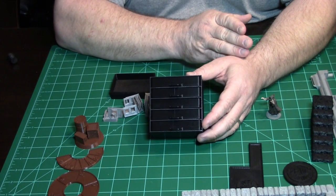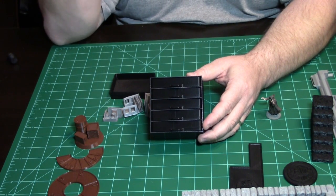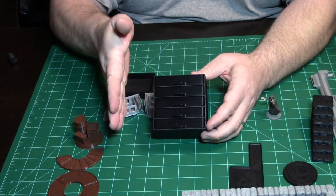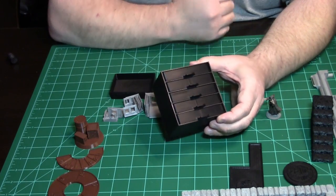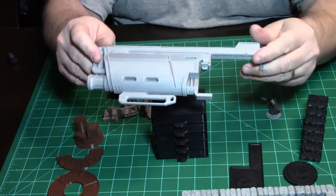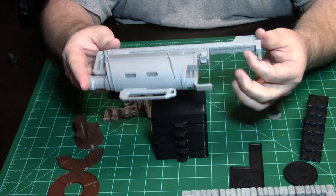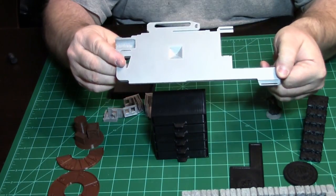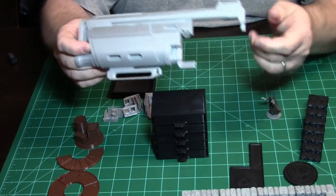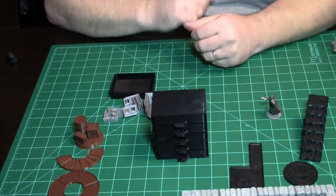If you want something a certain size and it's not that size, that's where digital calipers come in. You can measure it and scale in Simplify 3D — it has a box that locks the ratios. Scale to 125% and you get a box just a little bit bigger. You can do that with any STL file. If you don't have an 8-inch print bed and want to test a piece, just scale down to 50% — as long as every piece is 50% it'll snap together the same as at 100%. A guy with a G-Max printer with a huge bed could go 200% and make the gun almost rifle-sized.